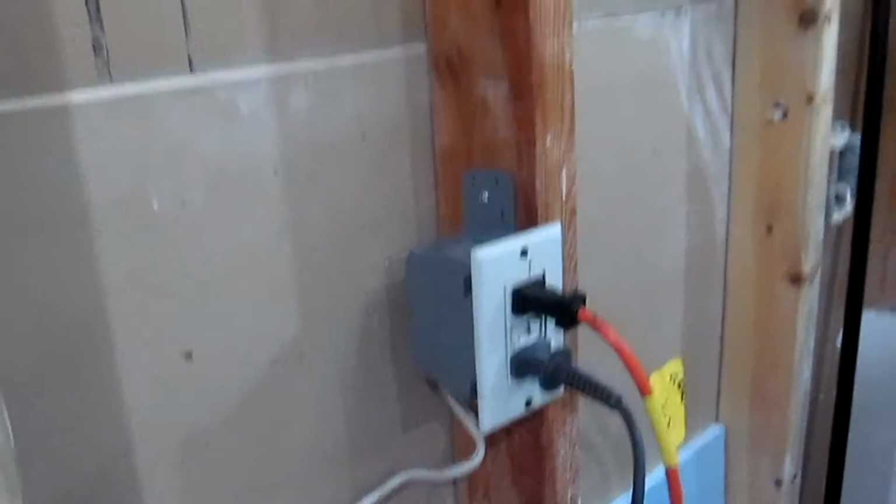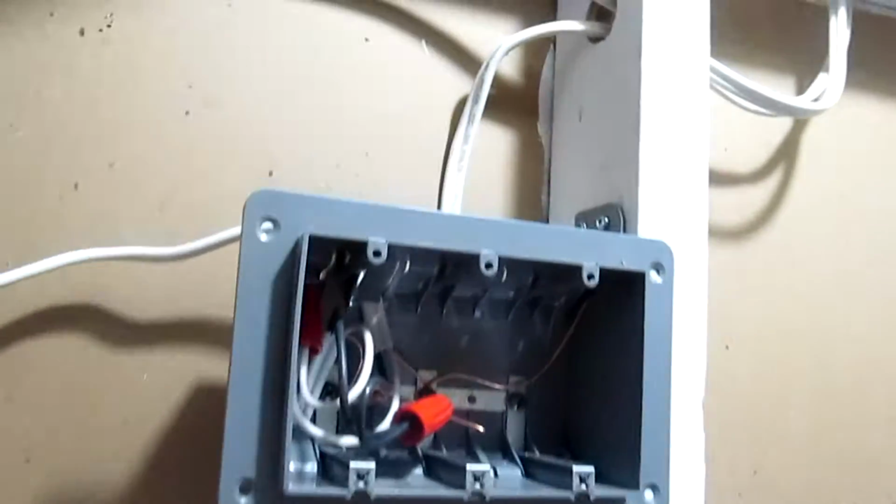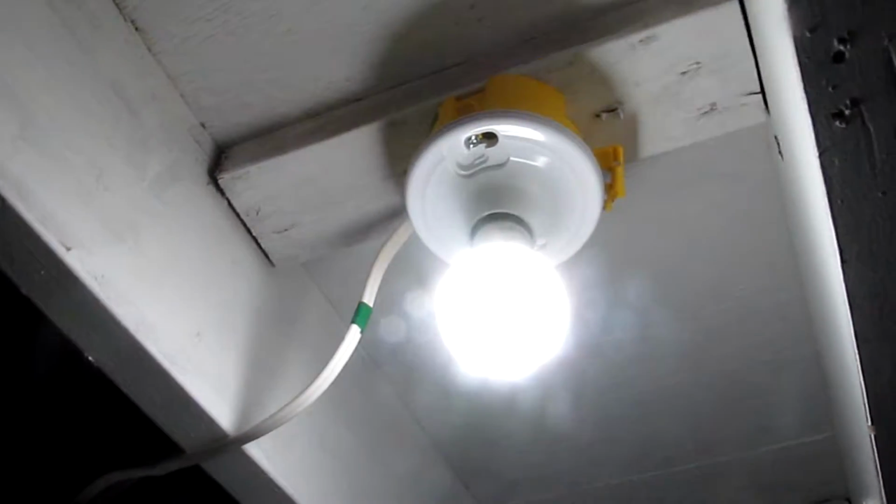And coming out on one of the lines is here, and it's going there and down to this junction box right here, which now connects the living room over there, as well as the other room outlets, and this GFCI outlet here. Then over here, I've moved the junction box and put it in place on this side. And of course it's got power coming in from over there. This light has been moved from there to there and a line eliminated and the switch put into here.